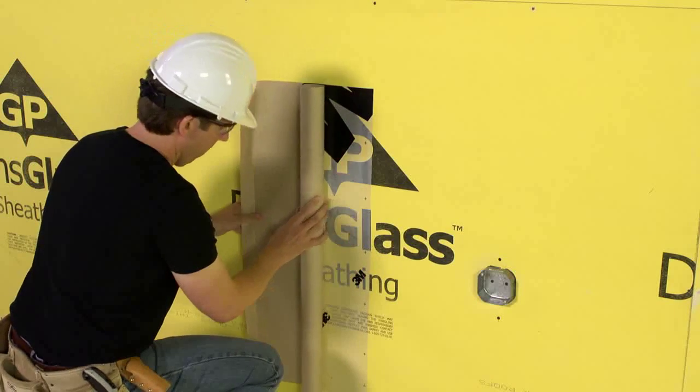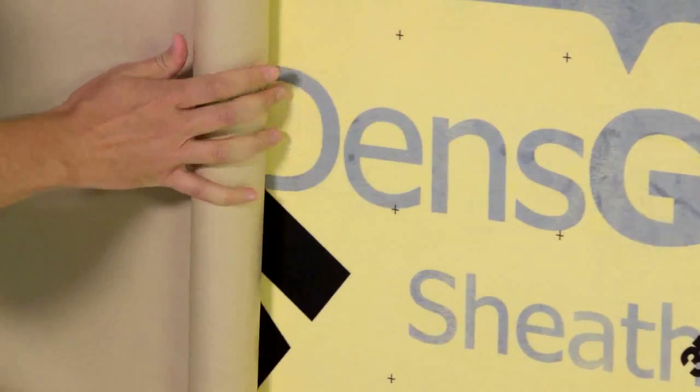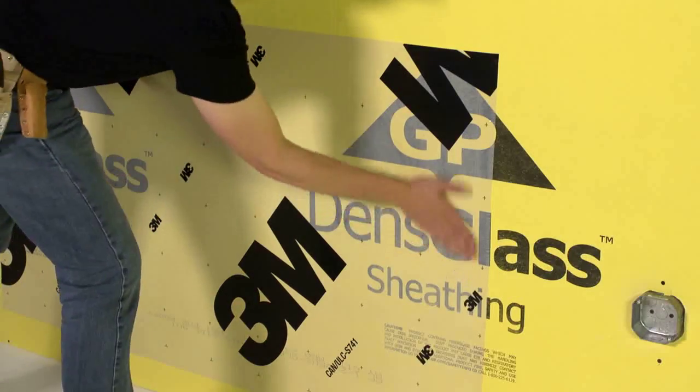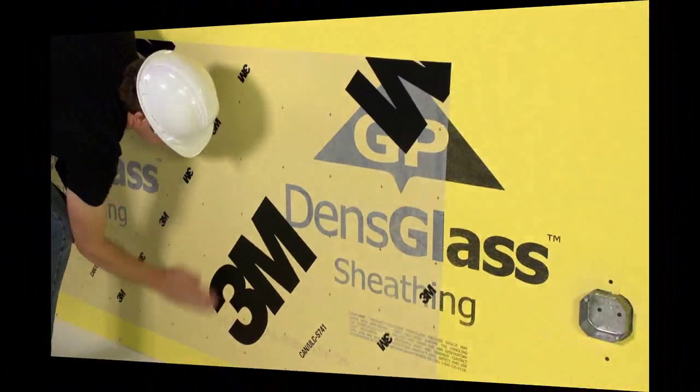Begin unwinding the roll while simultaneously pulling the release liner. Maintain pressure against the wall to tack the membrane in place. Continue across the wall. To smooth the surface, wipe the membrane with a feathering motion from the middle outward.